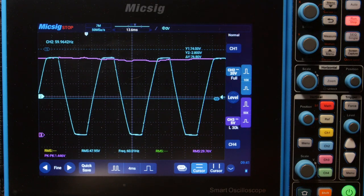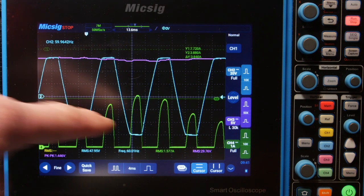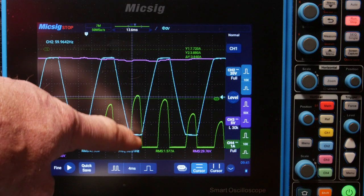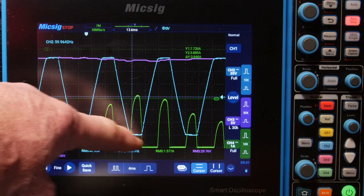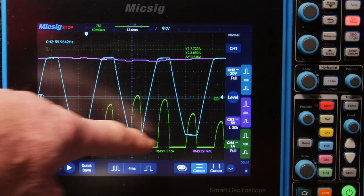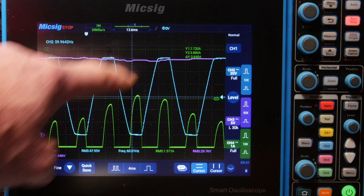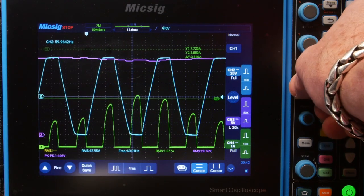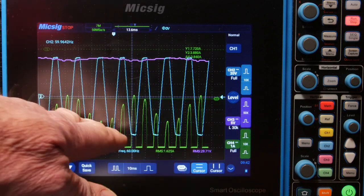Look at the top of the thing. You see these big spikes of current? That current — 5 amp peaks, a little more than 5 actually — that 5 amp peak has a voltage drop in the transformer that actually flatlines it. Right here, same with this one. This current's not quite as tall. So you can kind of see how it's changing the waveform. So we're not getting the peak waveform out of the transformer that we would have expected because of these high peak currents.